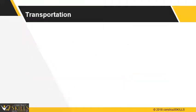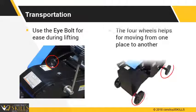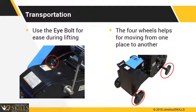Transportation of machine: Use a mini crane to load the machine onto the tempo and transport it from one site to another. The machine is provided with a lifting plate along with an eye bolt for lifting with cranes or similar devices. It has four wheels for moving from one place to another at the construction site.